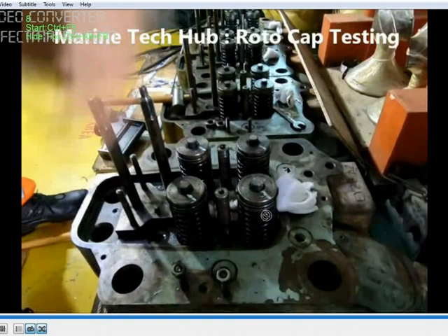This is very important. You can lubricate the rotor cap when the generator is stopped also, by putting oil on this side and checking that the oil is coming through all the holes. This is very important for the third engineer. Make sure that the rotor cap is assembled properly. I was talking about the cotter pin — all of them have two cotter pins — it is pressed and the cotter pin is assembled.